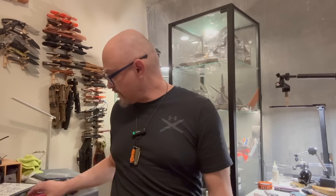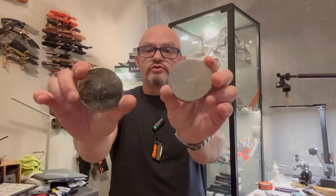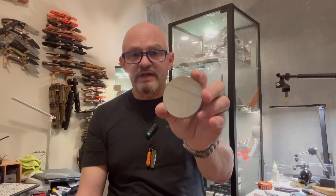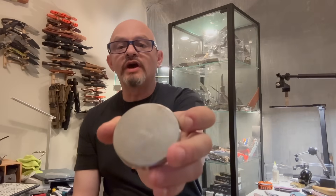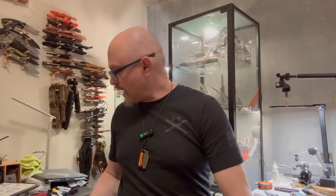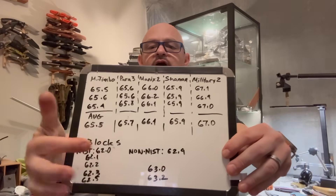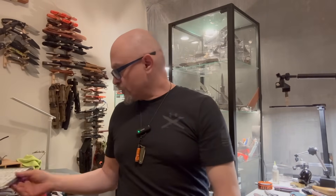I'm trying to keep it under 15 minutes. There are a couple interesting findings I'd like to share at the end about the knives. I used two blocks because I got nervous about some of these blades being above 66. This one is NIST-certified. My backup block is certified by Phase II to be at 62.9 HRC. I use it sometimes to double-check myself because I don't want to give you wrong information. The knives gave me results of 65.5 to 67 HRC — a 1.5 HRC spread. I think this is legit.